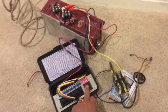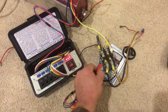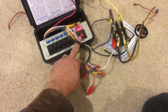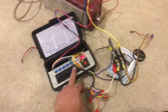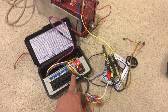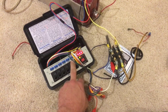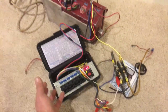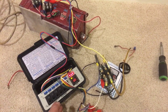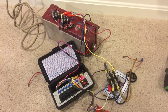Now we put it to active. Before we put it to active, I'm going to go ahead and hook up our wire that they typically use for W heat. I put it to active and let's go ahead and call for heat right here. And the light appears, telling you that it's called. You can just check that, and basically you can use any wire to check for anything — it doesn't have to be what it's labeled for. Thank you for watching this video, I hope that it helped. Have a good day.